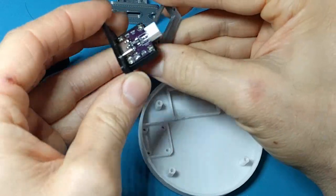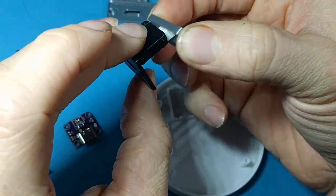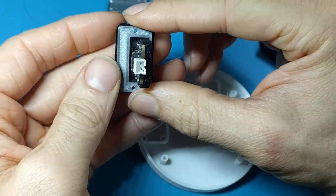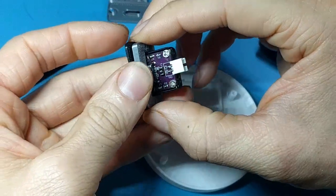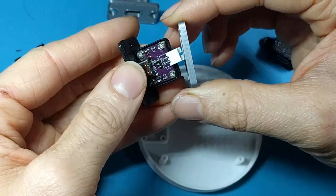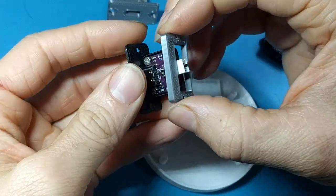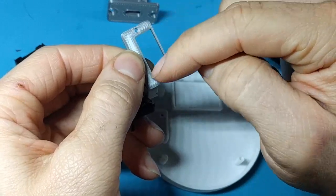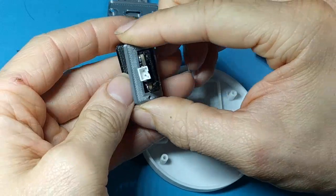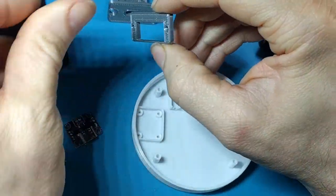And then there's this nice little guy. What's cool about this is I made a version designed to be tapped with self-tapping countersunk wood screws. Back in the day when I was doing panel mount stuff all the time, I'd have to struggle with little M2 nuts or number 4-40 nuts — it was such a pain. Now I can just put this on and tap the screws right through. Even better, this square outline and these two holes let you take a Sharpie and dot the corners to give you a sample frame to cut out — so you know where to drill to put your board in. The wider frame will cover up any imperfections in your drilling. It's kind of an ideal panel mount solution.